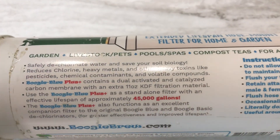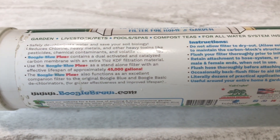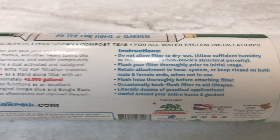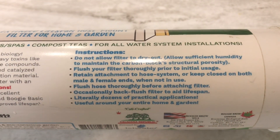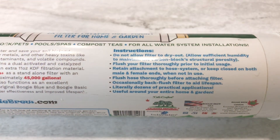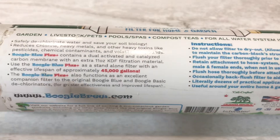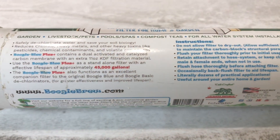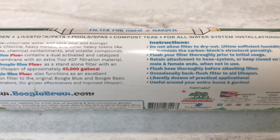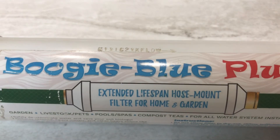This is not directly listed for drinking water, so it does not remove all bacteria and pathogens, but if you're using it for showers or toilet water from a rain catchment system, this would probably do the trick. There'll be links in the description for this filter. The biggest thing to remember: do not allow it to dry out — I store this filter in a gallon Ziploc bag. You're supposed to back-flush it using a male-to-female adapter after use, which flushes contaminants backwards out of the carbon block so your filter lasts longer. It's rated for 45,000 gallons — a real good filter, and the price isn't bad for what it is.